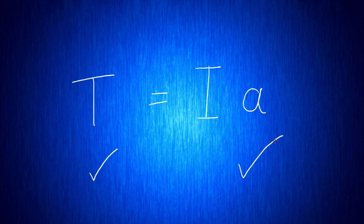Calculating moment of inertia from dyno results is really simple: torque equals moment of inertia times angular acceleration. We already know the torque because we measure it directly, and we know the angular acceleration because we record the RPM and compare samples. The only unknown is the inertia. Since the moment of inertia never changes — it's a physical property of the mass — we can calculate it continuously over the entire test and verify consistency across different voltages and throttle positions.